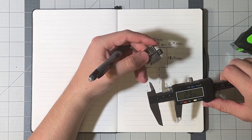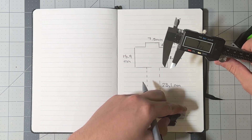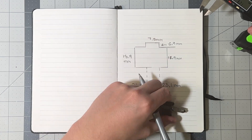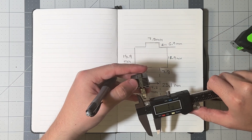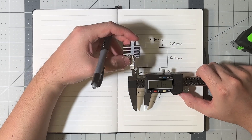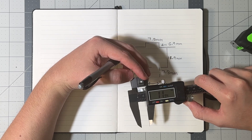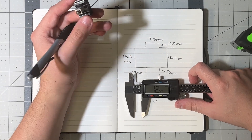The length of the nozzle is about 7 mm, so I'll give it 7.2 mm. The underside measures about 7.8 mm on one side. The other side comes to about 11.77 mm, but I'll round it to 12 mm. To be honest, you'd rather have it a little loose than really snug — if it's too snug the item might get damaged or not fit, but if it's a little loose it will at least fit inside the compartment.